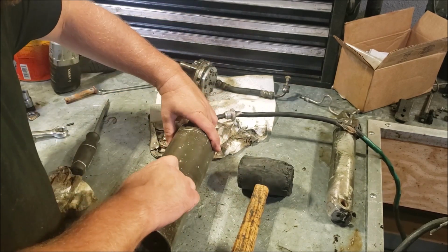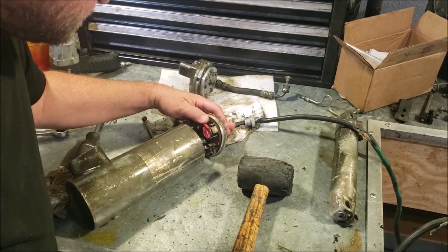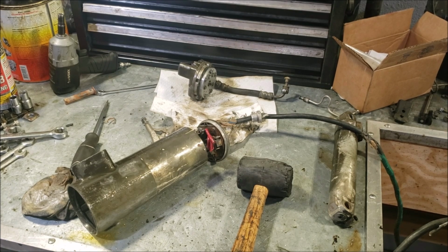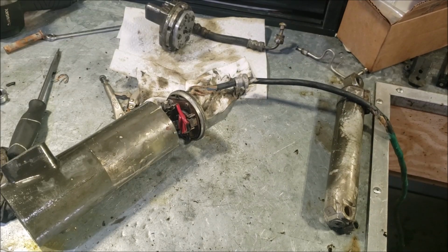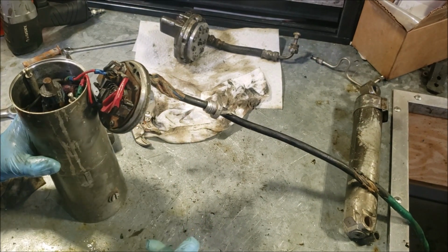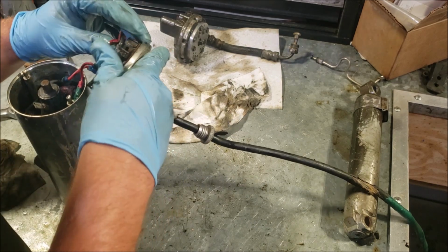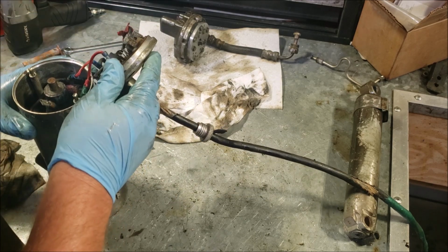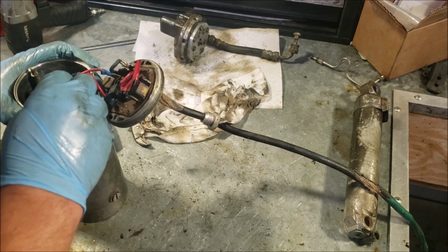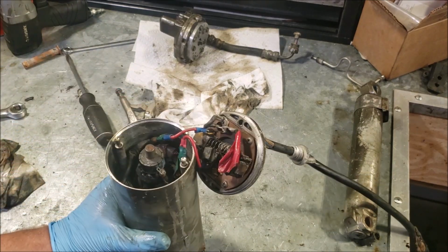Yep. All right, looks like we got some custom repairs with some, looks like duct tape, red kind, so that's good. All right, so we have a well burnt looking armature down here, a lot of corrosion, one stuck brush. Oh, jeez. This thing is destroyed. One seized motor. Seized in the armature. I mean, this thing is screwed up.